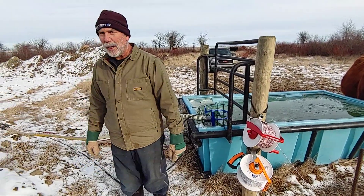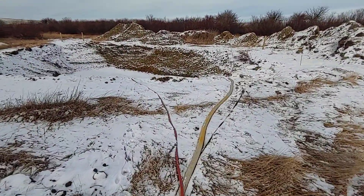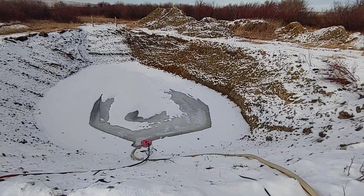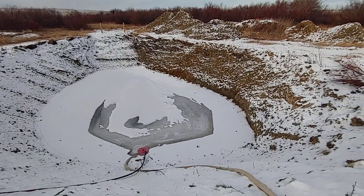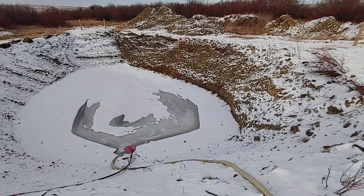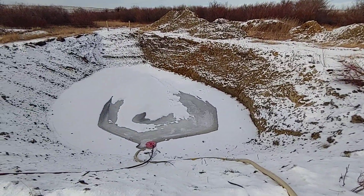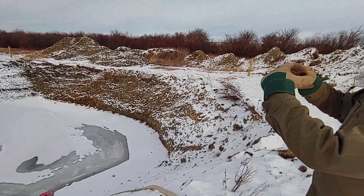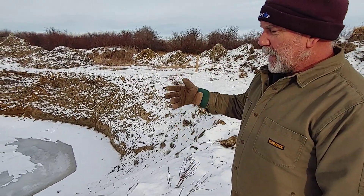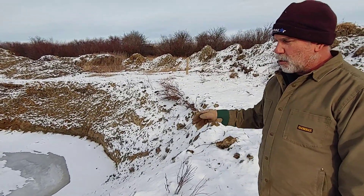Just learning the hard way. Down in the dugout, which is a very small dugout — just a puddle — there might be a total of five or six feet of water down there. It has dropped probably 16 inches in the last week. The water does come in at night — you can see the horseshoe-shaped layer of ice because the water comes in, cracks, lifts the center of the ice, and flows in to fill that gap. But it's coming in slower than what the cows are consuming, so we're actually drawing down the level of the dugout.